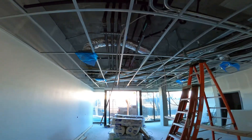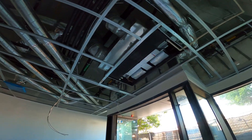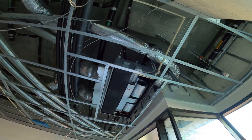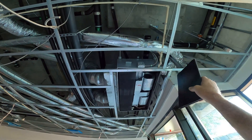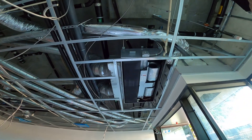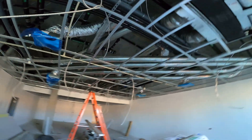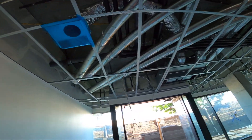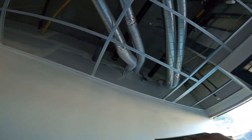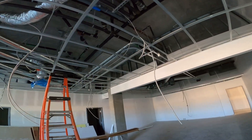This is T-bar so that'll fly back here, but I have an issue with this plug box my guys put out here for this unit. They mounted the box on the side of the unit — there's no access to this. It's not going to be an access hole, it's just going to be a plenum. We're probably going to have to drop that switch into the hard lid, and there's no entrance up there. We already have an issue with a couple boxes up here — we're going to have to have an access panel.